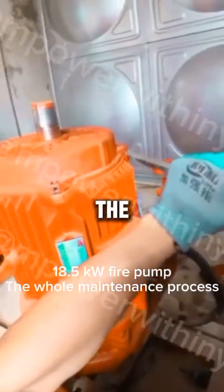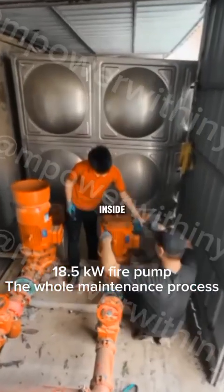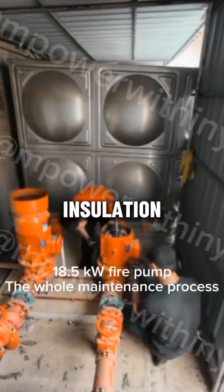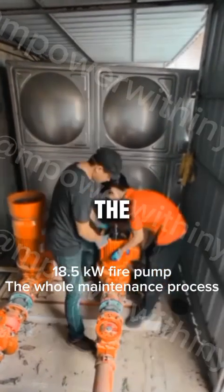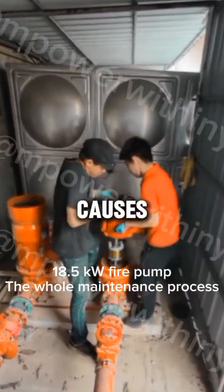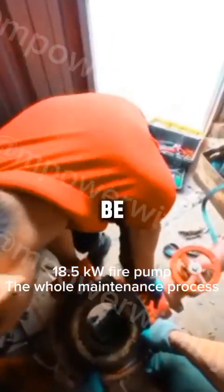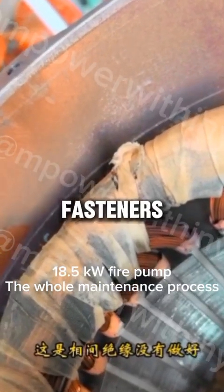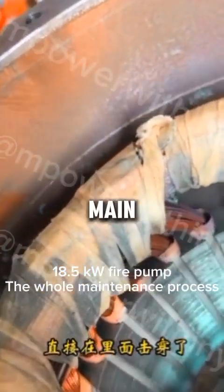The reason for this is that the burning damage you're looking for happens inside this upper section. This type of failure is very commonly due to poor insulation material right at the shoulder of the windings, which is what ultimately leads to the internal short circuit. Do not bother with the bottom at all. After you have successfully removed all the fasteners at the top, you can then proceed with the main repair.